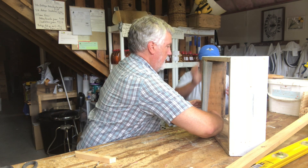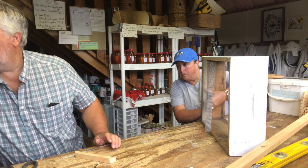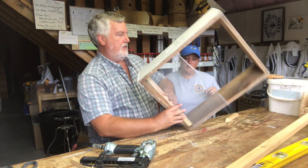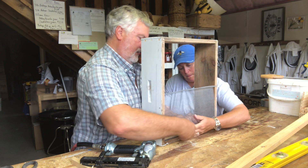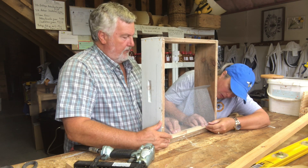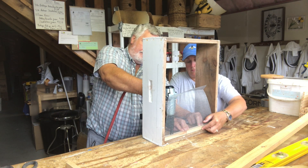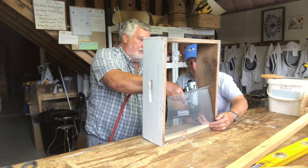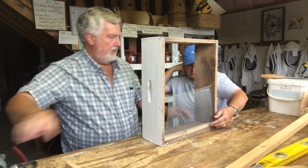Can you get a hand on this from that side? Hold it tight against there — that's going to work. I've got some staples. I'll point it downwards rather than shooting you with it. So we're getting this flat and into position. The nails will actually do the job better. Okay, so we've got it tacked into place right now.